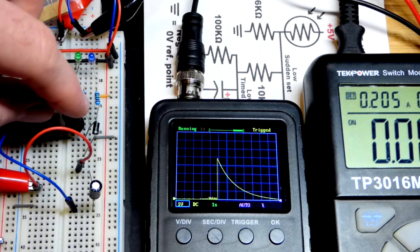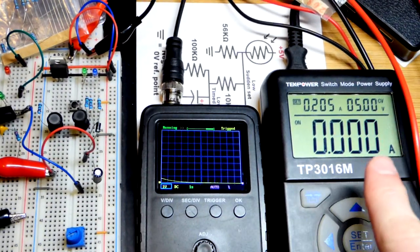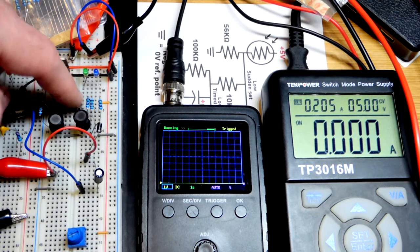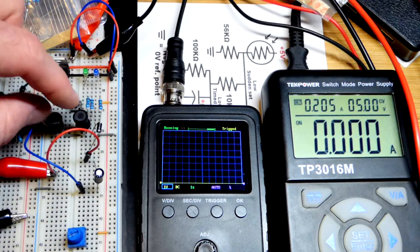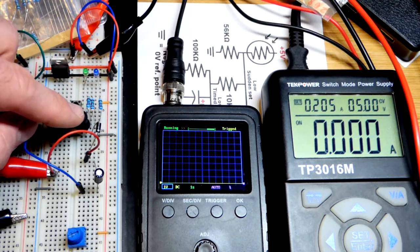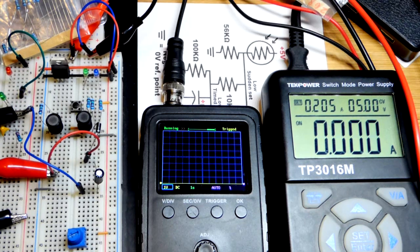The main takeaway is we were able to boost the voltage higher than our power supply voltage. They make modules that do a really good job — probably 80 to 90 percent efficient — whereas with this setup, especially with the oscilloscope attached, we're losing all the energy and getting effectively zero percent efficiency. But the main thing is it's still an interesting component: it can actually create a higher voltage than the power supply. That's because it's going to move current however it can — current requires voltage — so to keep current moving through a resistance, it needs to create a voltage. Thanks for watching, check out the other videos, subscribe and click the bell.